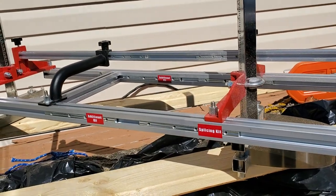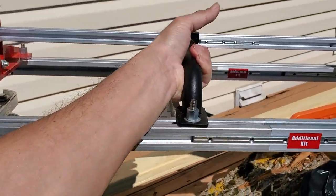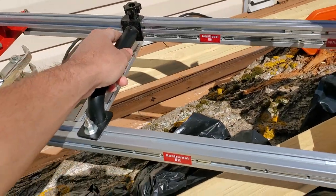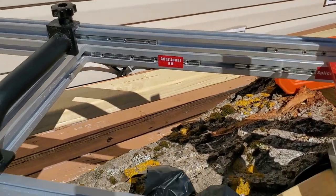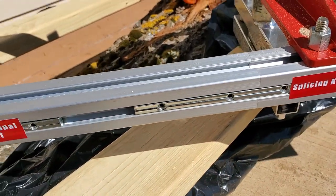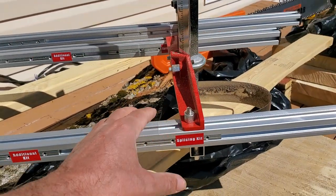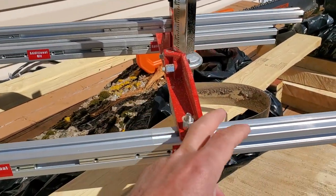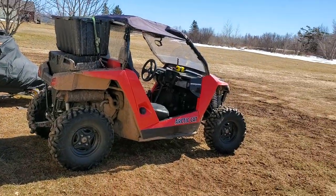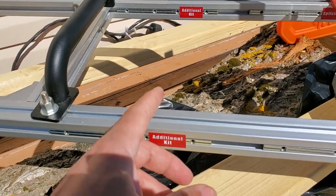This mill was almost effortless to use and it's not heavy at all — very light. I can lift it with one hand, arm almost fully extended. It's mostly aluminum and it's not cheap aluminum — this is solid quality. As long as you put it together properly you should have no problem. Make sure you tighten all the set screws on the splicing bars. To me at first that seemed a bit sketchy, but it's great because the mill breaks down into a much smaller piece of equipment. You can remove a section so when I use a shorter bar, I won't have it getting caught on everything when I transport it in the side-by-side or carry it out into the forest.